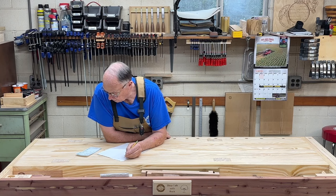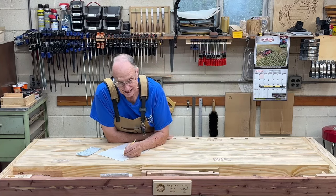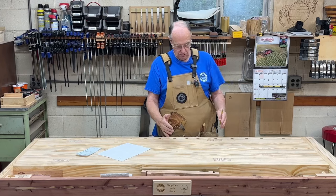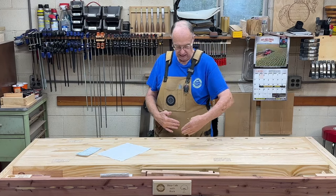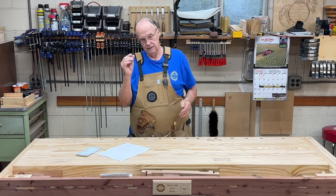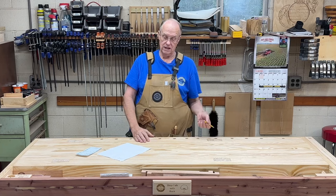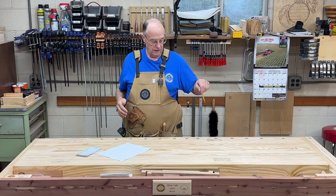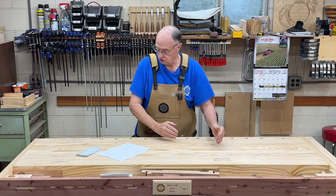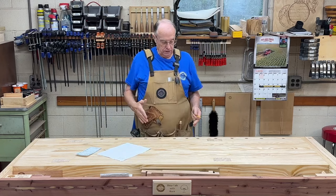Okay, I'm going to fix this so it just sits down right over the stove. So it's on the inside. It's 18 inches deep. If you're standing here looking at the stove, it needs to be 18. That's going to give me about a half inch or so, because I don't want to be that much short. It will screw everything up. So I'm giving myself a half inch, but that's only a quarter on each side. If that's going to be a problem, we can take some felt, put it around, and be a little cushion. But the width is 12 3/4. Now this is inside measuring.